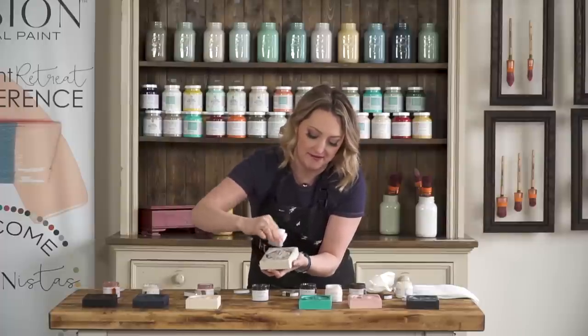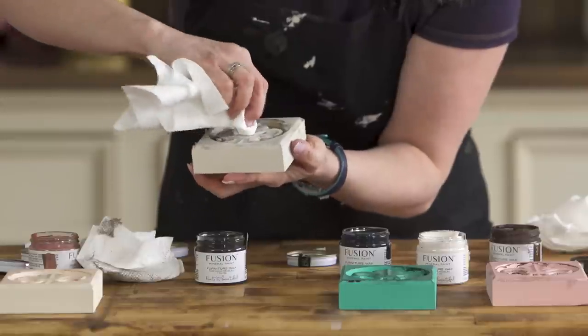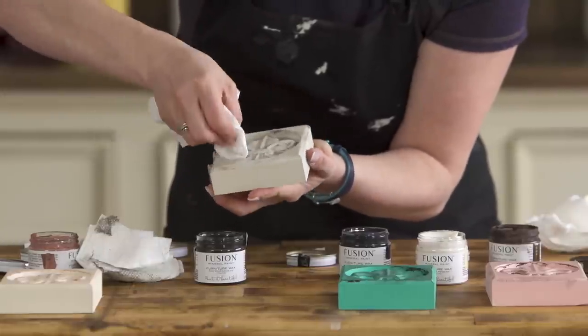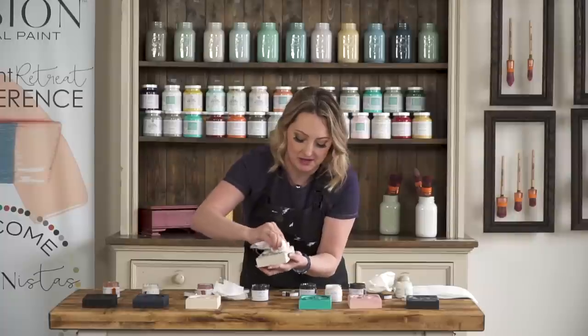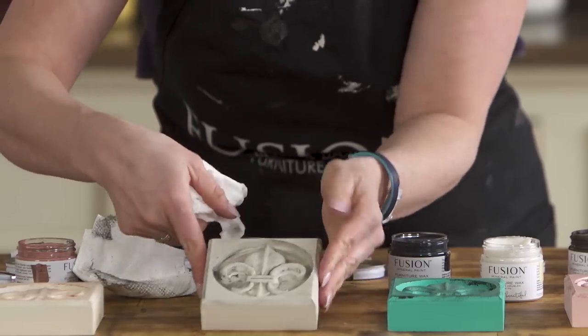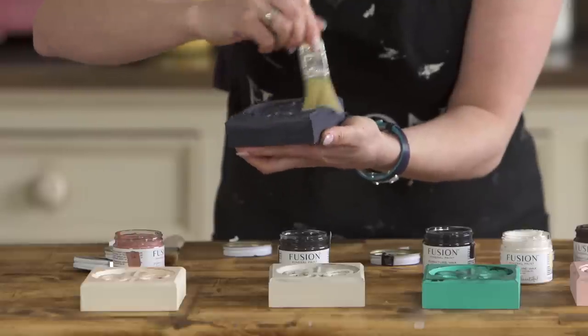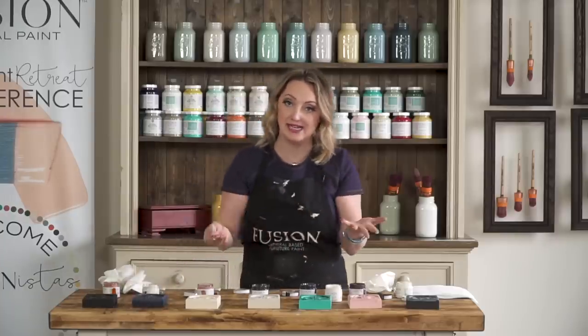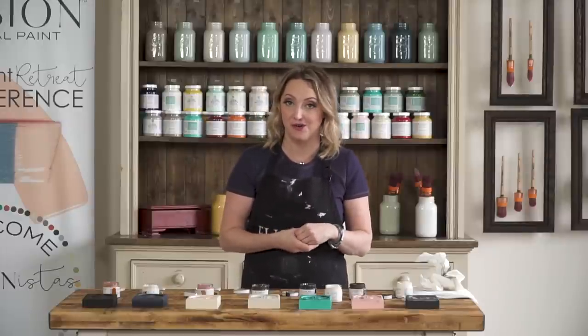This is a really great effect to get even more depth — getting into the recesses and removing excess from the top surfaces, but seeing the darkness in the lower areas. I recommend using a lint-free cloth or shop cloth; it makes it really easy to work with. You can come back after 30 minutes or so and buff. If you want more of a metallic effect, you can add another little touch just to highlight it again. The key with wax is you don't want to apply too much — too much wax can cause haziness and take a really long time to dry. This is our beautiful range of different colored waxes and it's an excellent way to get a decorative faux finish look.